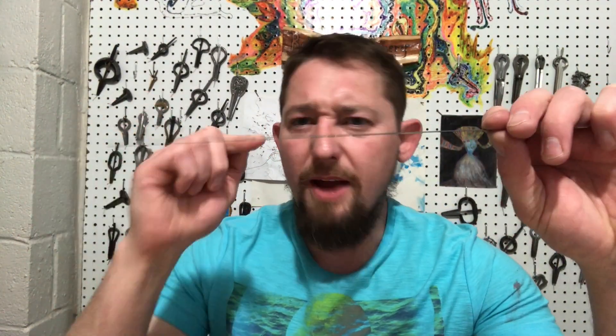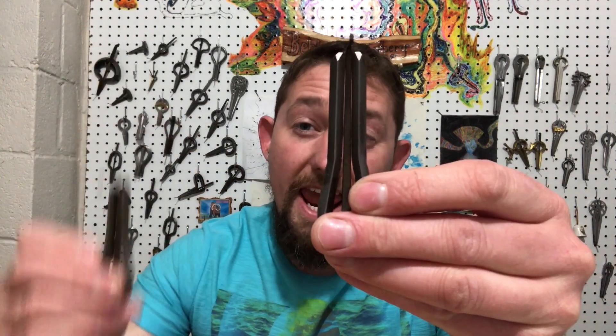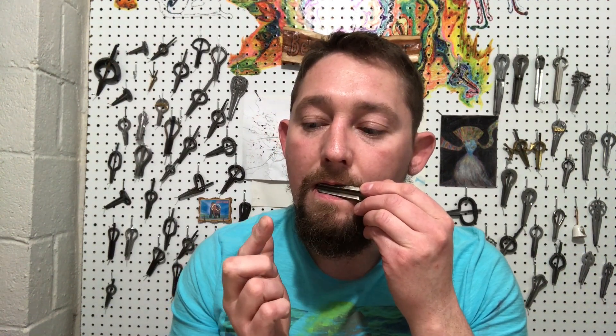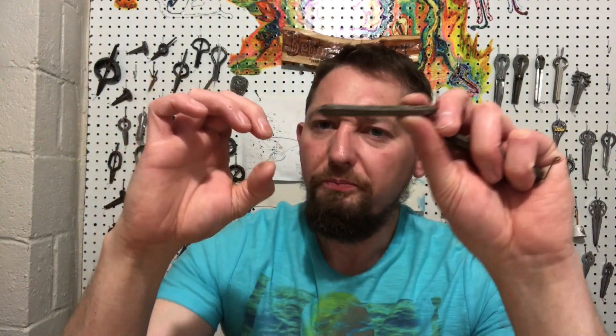I can have this given reed thickness vibrating at a specific frequency. Let me give two examples of two very similar length harps that I make. This one here is an A1 sharp — the reed thickness is 0.020 spring steel. It has a fairly thin reed. Here I have one of about the same length. That's a D2, which is a higher note. The D2, the higher one, is quite a bit thicker — this one is 0.025 thickness. So it's a thicker reed.